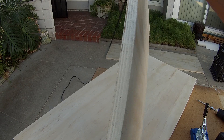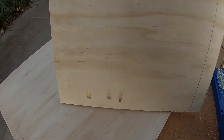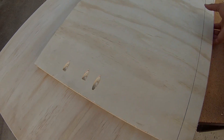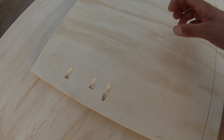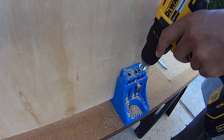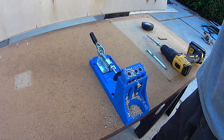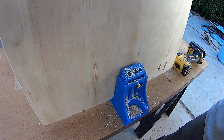I did some fine measuring — this board is 11/16 inch, which is pretty close to three-quarter inch, just a little shy. So I put it on the three-quarter inch setting. The five-eighths setting was obviously too shallow. You can see the pocket hole there — there's a nice little flat seat inside the bottom of the hole, and you use the special Kreg screws to seat in there. That was my test board. I'm going to drill on my actual board now and do the first joint.